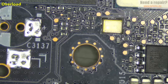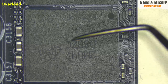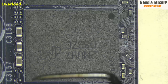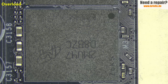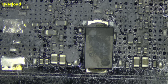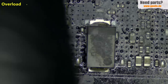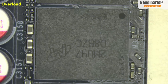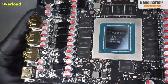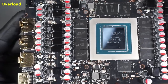Let's do a visual inspection on this RAM chip to see if there is visible damage. We are on the same corner — the left side, first and second RAM chip, exactly this one. The thermal camera showed the hot spot around this corner, but actually I cannot see any damage on this chip — nothing visible. I'll turn the board around to look at the bottom side. There are a lot of capacitors on the bottom side but nothing damaged. The thermal camera clearly showed the RAM chip itself getting hot and not something underneath it.